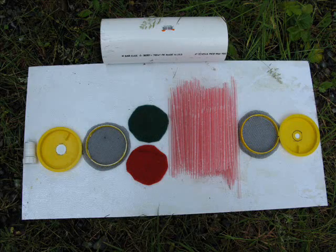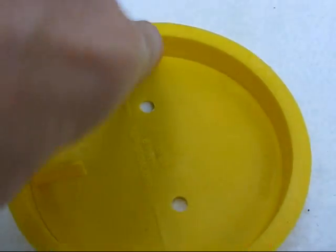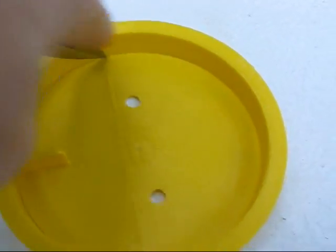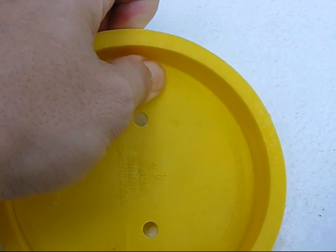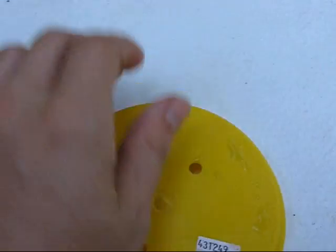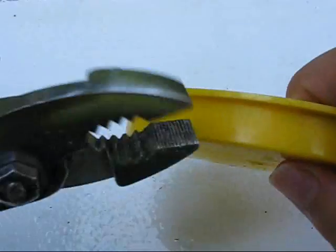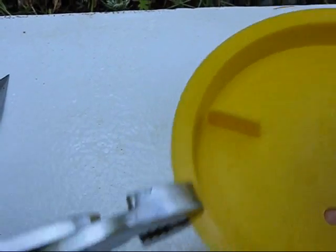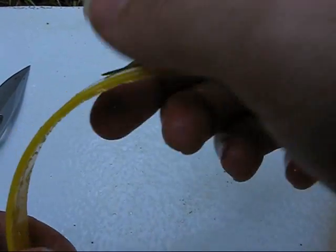Here's the photo of all the supplies in the order water flows through them. To turn two test plugs into rings, you'll need to cut along the inside of the plug. These plugs are made so that after a little cutting along the inside edge, the surface of the plug can be peeled out by adding pressure. We're using a folding knife that locks open — Swiss Army knives will often close by accident, so use those with care. Box knives are also great. I'm obviously not actually demonstrating this; we got so excited testing different outlets that we used all our test plugs. To remove the lip of the test plug, fold the lip back with a pair of pliers around the circumference of the circle, then go back with the pliers again to pop the lid off. Any remaining chunks can be popped off or shaved off with the blade, and you'll get a ring like this.